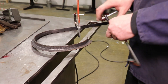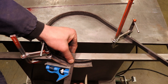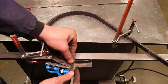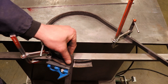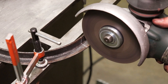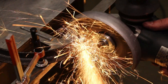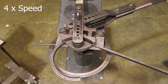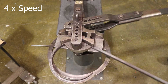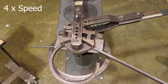I'm going to clamp this part down well before making that cut. I'll lay a combination square and a nice sharp piece of soapstone to mark a line — soapstone gives a nice bright line and we can trim up to that line a little later.